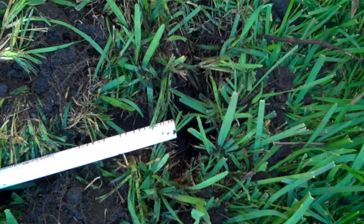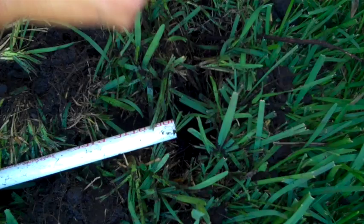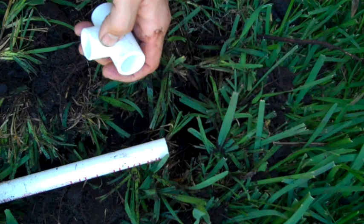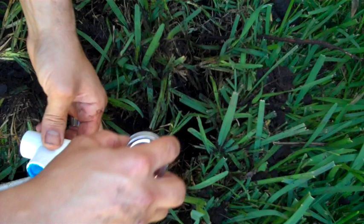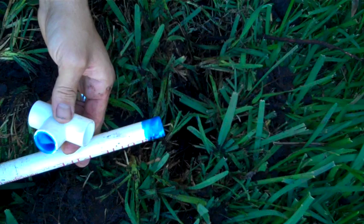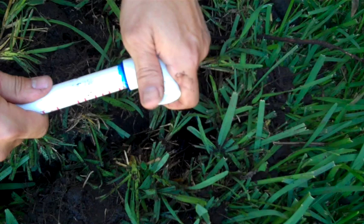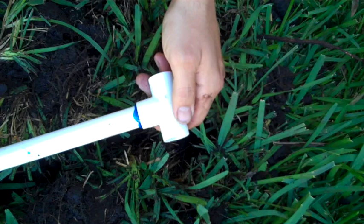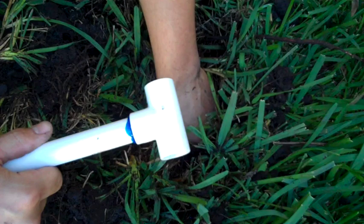I'll show you how to do that. This is a little difficult to see because it's down in the ground, but I'm going to try to show you anyway. You want to wipe off as much of the dirt as you can and make sure you've got a nice straight cut. Try to get all the dirt out of there. Take your glue, put a little bit on the inside and a little bit on the pipe — and again, this is the rain or shine stuff, so we're working in a wet environment and that's what you want. Then push this together. It's going to set really quick, so make sure you push it all the way on and hold it there for a moment because it has a tendency to want to push out on you. Hold it until you feel it setting.